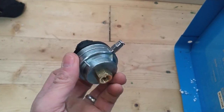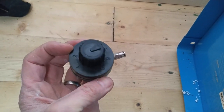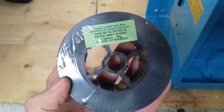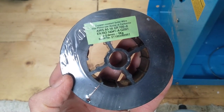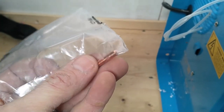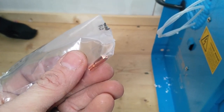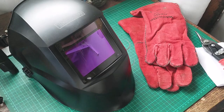I did buy another gas bottle and when I found that we'll probably move to that. There's also a one kilogram spool of 0.6 millimetre welding wire, and a spare tip included — this one is a 0.8 millimetre tip. With the Pro 90, the torch comes pre-fitted with a 0.6 millimetre tip. So let's get all of this set up and see how we get along.